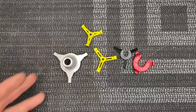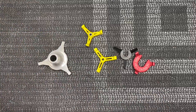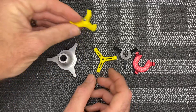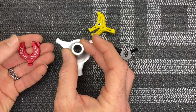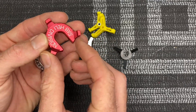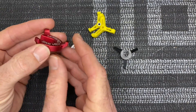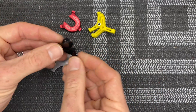Another important thing I recommend for your specific size helicopter is swashplate levelers. I have multiple different styles here — aluminum ones and 3D printed ones. If you have access to a 3D printer there are tons of files out there. If you're running SAB or Align they make different sizes — this is a ten millimeter for an Align 700 size helicopter. The SAB style has a little magnet in it so you lift the swashplate up, slide it under, and there's no need to disassemble the head. I highly recommend picking up a swashplate leveler for the size of your model.